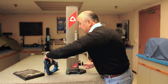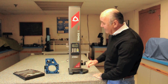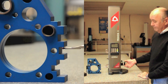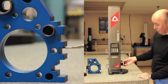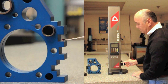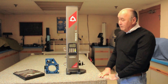Think about a measurement you probably do a lot: the center line of one slot to the center line of another slot. That's a standard measurement that would take some time normally. But with this gauge, all we do is go into diameter mode, go into this slot, go straight down and straight up — there's the width of the slot. When I take the load off, it gives me the center line. I go to reference two, set zero off that center line, come over to the next slot, go straight down and straight up, and there's the distance from the center line of that slot to the center line of this slot — a little over an inch.